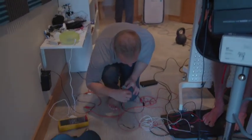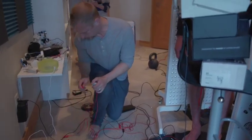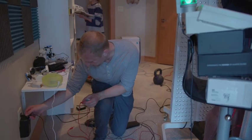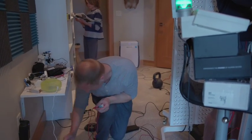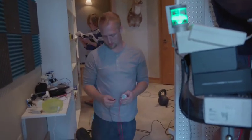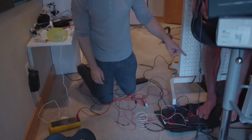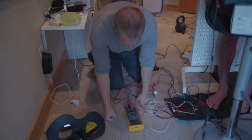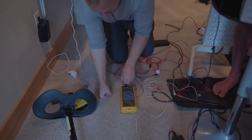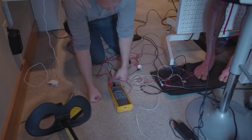I'm going to use this because now that's connected to you, and this is the ground. So I'm going to ground. I can remove these patches if I need to. Yeah, leave the patches on because you're going to be my ground source. All right, I'll take this out. All right, so now I'm connecting to this ground to test that. And this is connected to Ben's body, which is touching the grounding mat. And now I've got just a tiny bit of DC current. .45 millivolts.